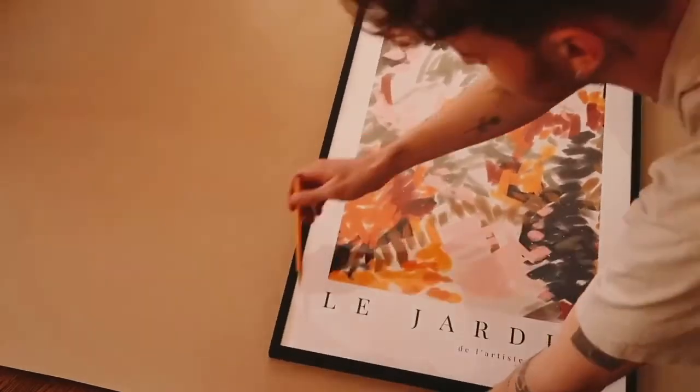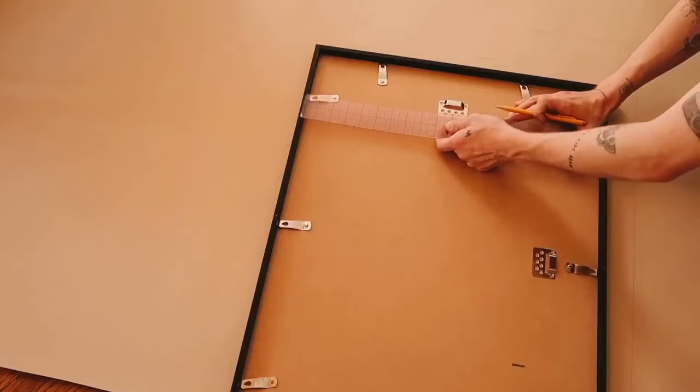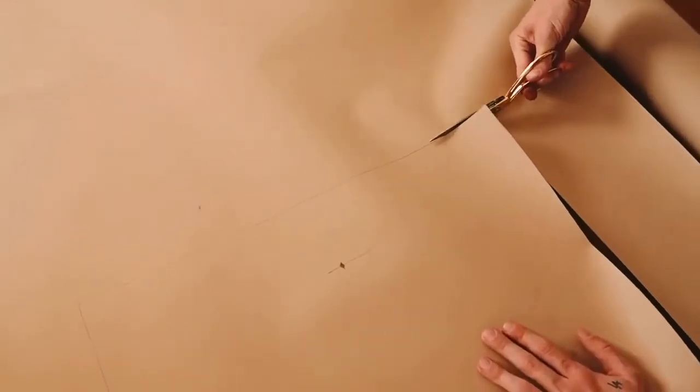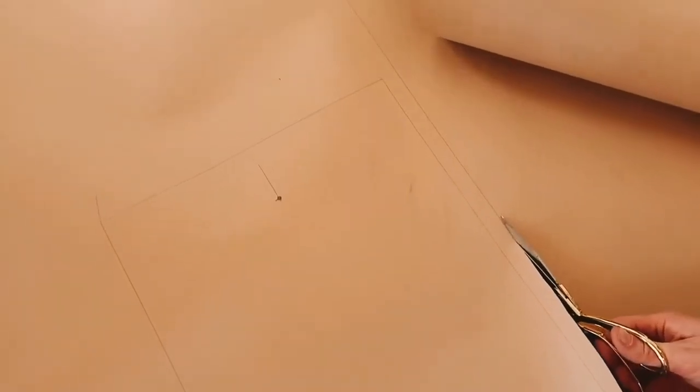We're on our last tip, and I wanted to save this one for last because I've talked about it multiple times on my channel — creating gallery walls. When you do add more and more pieces, it gets a little daunting when you have to start hammering nails into your wall, making sure placement is right. A great way to do this is to create templates for every single picture. Grab all your frames and create individual templates by laying each frame on butcher paper, newspaper, or printer paper — whatever's large enough — and trace out the shapes.